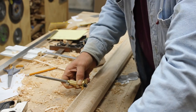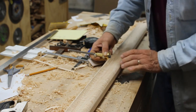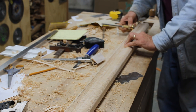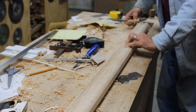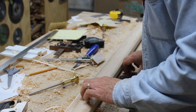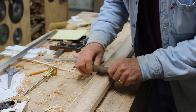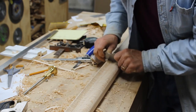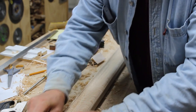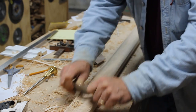I'm just about there - maybe a couple of shaving passes will get me there. I've marked it with a pencil line, so I'm going to take down some more. The edge seems to be holding up pretty well on the scraper, so I guess I did a good job of shaping and sharpening it. I'll know that I'm deep enough when this saw kerf disappears - I've got from about here, about half of it to go. Right now I'm tilting it so I can get a good bite on it to clean it off. But after, I'll sharpen this one more time and then try and stand it up a little bit more - a little straighter - to get the profile a little more accurate.